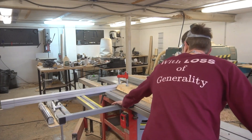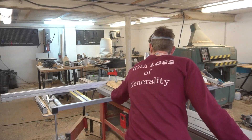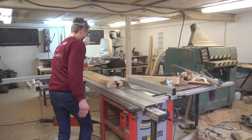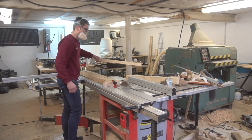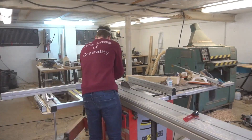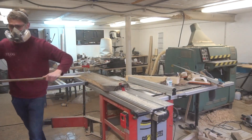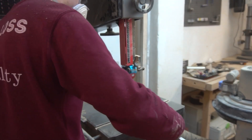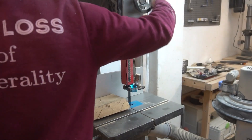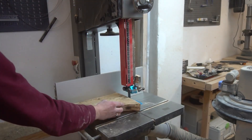To create small boards, I first need to turn all those live-edged pieces of maple into dimensional lumber with one straight side each. My sliding table saw and that sliding table make quick work of that. Then I set my band saw fence to be just proud of the mentioned 8 cm of board width and got to cutting, ending me up with thick, luscious maple wood planks.